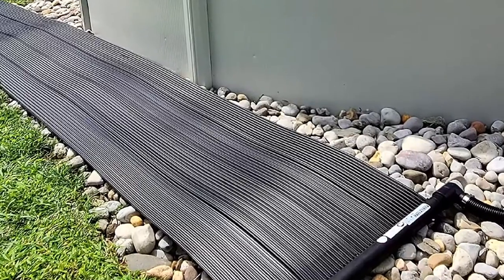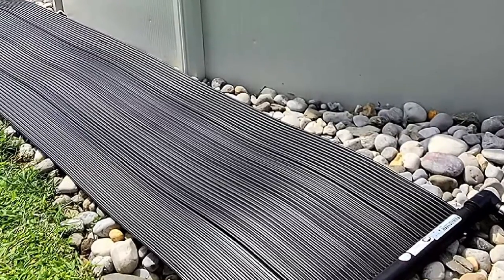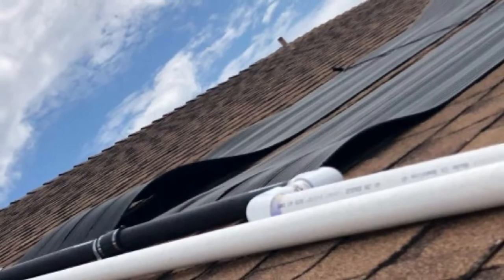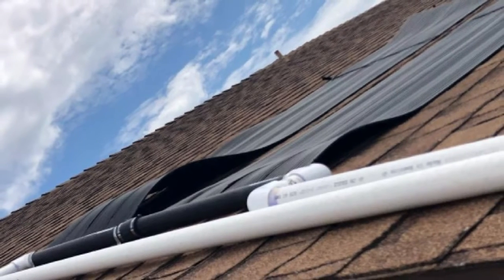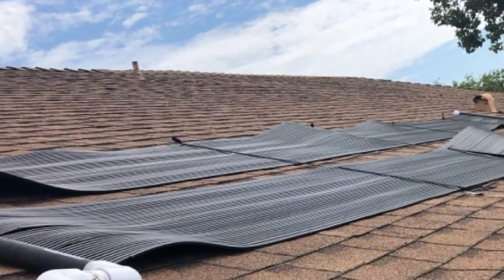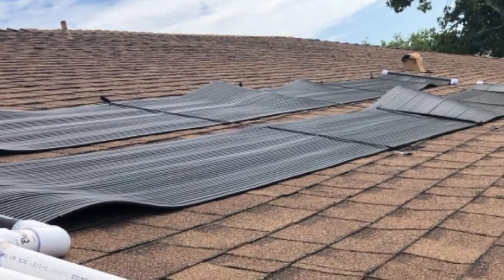The Xtrema Power Solar Heater for pools has been designed with high-grade materials that can resist harsh weather conditions. The heating system includes a round 1.5-inch header manifold attached with a rubber coupling. The solar heating system is ideal for above-ground pools below 18 feet round, and for up to 350 sq. ft. oval pools, although by adding another solar heater mat, higher capacities can be obtained.